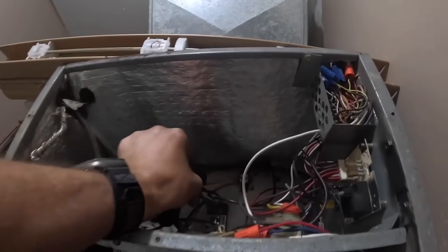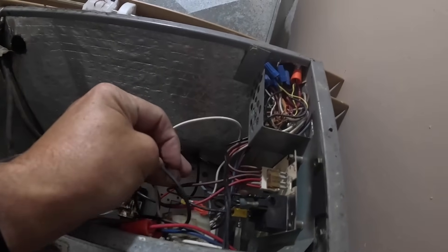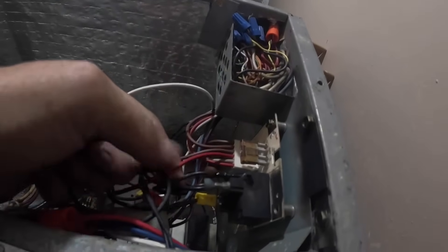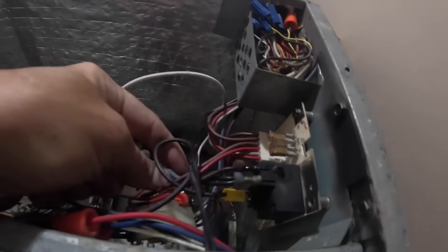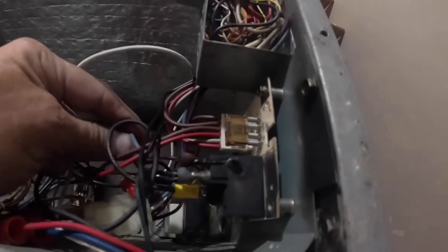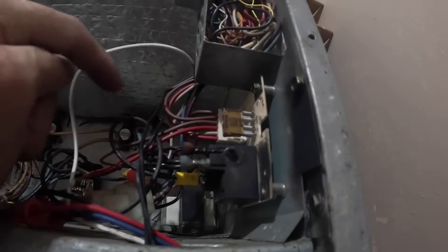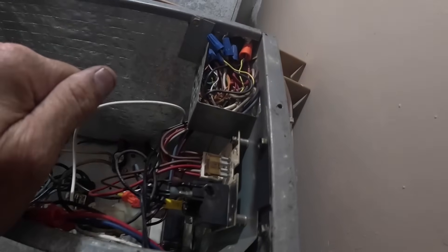What I was trying to show you — on this heater kit, this wire right here is for your blower. This black wire has power all the time, and this blue one that has turned brown right there only has power when the heat strip is energized. But this has melted together, so it is sending power backwards through this blue wire to the heat strip and bringing on the blower. So they need a new control board.